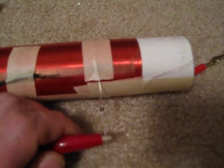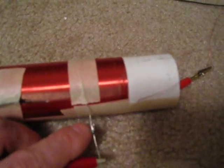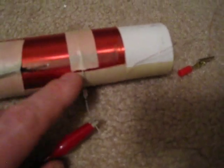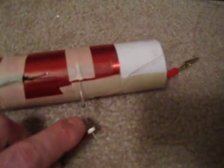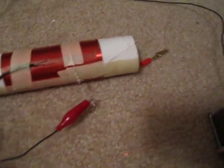Here's a really important part of any crystal set — the germanium diode. This is a 1N34 germanium diode; I picked this one up from the Crystal Set Society, but there are other sources that carry them. You want to get a 1N34 or germanium type diode — they work the best. The unbanded anode end of this diode is taped — not soldered, just taped — to a spot on the coil where the enamel is sanded off. The cathode banded end serves as one hookup for the earpiece or amplifier.